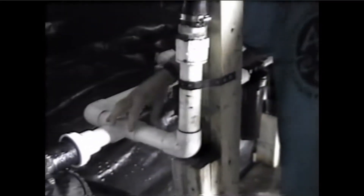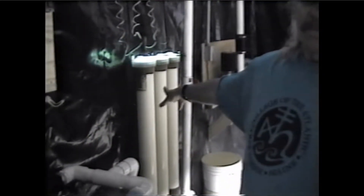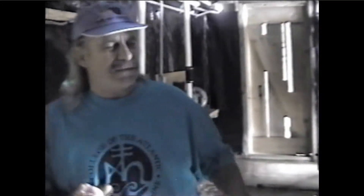At 50 microns it goes into a tube and splits off here at a T. Half goes up into the settling tanks inside, and the other half goes into two 20-micron disposable filters — these will normally last about two weeks before changing. It goes from 20 microns down to one micron, so we end up with one-micron seawater. From there it goes into our UV sterilizer, which kills bacteria. So we end up with one-micron sterilized seawater — when you're doing hatchery work, you want it as clean as possible.